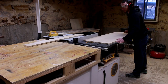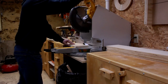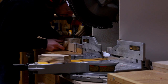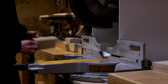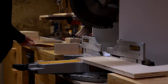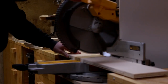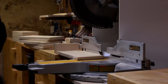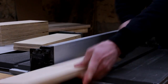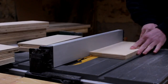Now on to the drawers. I was able to make three drawers using a single sheet of two by four foot three quarter inch plywood. I ripped everything down using the table saw and then made my length cuts on the miter saw. For the front and back sides of the drawer I used two scrap pieces from the same plywood, set my stop block to the exact width I needed, and made the rest of my front and back cuts — a much easier process that gives a very accurate result. I took all my sides over to the table saw to cut out the groove for the bottom paneling, cutting all the sides at once then sliding the fence over until I got a nice fit. Using a test piece comes in handy because it takes all the guesswork out.